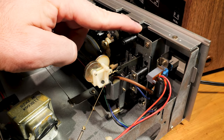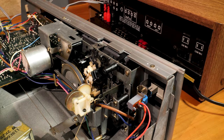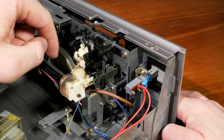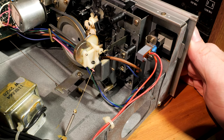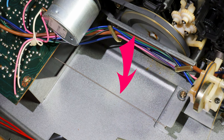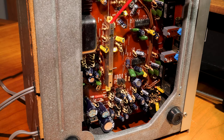The record key is linked to a little tab on the top of the tape transport — like I showed in the last video — that indexes to a little hole in the top of the cassette. The way it works in this case is pretty simple: it's just a little plastic lever on a spring that either obstructs the record lever or lets it move. Since that worked fine, I looked a little farther down and saw that when I pressed the key it pulled this spring, but the metal lever that it's hooked to didn't want to move at all thanks to some very sticky old grease.